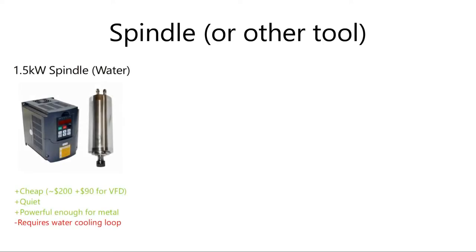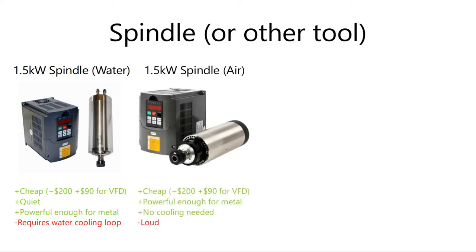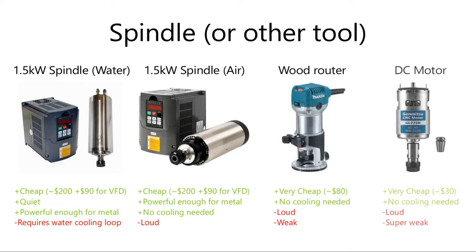Once you have the motion system figured out, it's time to think about the spindle. My recommendation would be a 1.5kW water-cooled spindle from China — this has been one of the best values for money on the market for a long time, especially since it's usually bundled with a VFD. Routers meant for woodworking, or motors disguised as a spindle, are usually not the best choice; I wouldn't recommend them if you're planning to mill any kind of metals, though they should be enough for engraving. A water-cooled spindle with a variable frequency drive costs around $200, which is a really hard-to-beat price, and it's a lot more quiet than an air-cooled one.